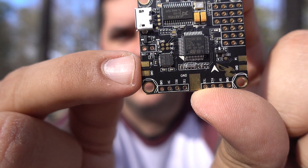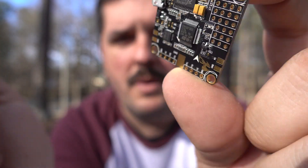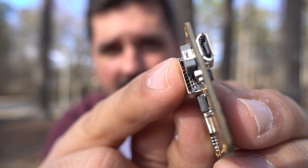The OSD is really easy to solder — these are the signal and ground pins for each ESC. The really cool thing is they're in the corners for the motors, so you don't have to run wires all across your flight controller. The sales pitch on this board is that it supports all Betaflight features right out of the box — that means it's DShot 600 ready, has a blackbox SD card slot for logging data, and you can do all kinds of logs.